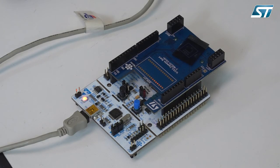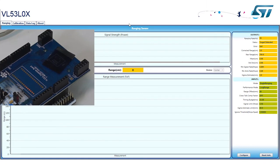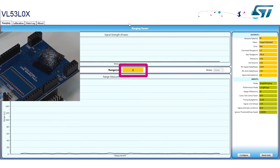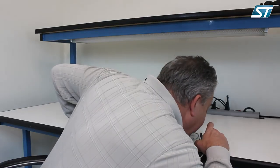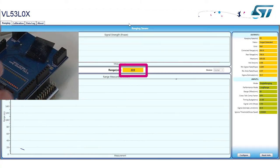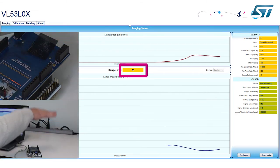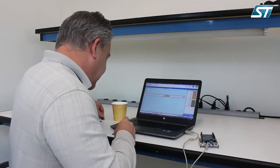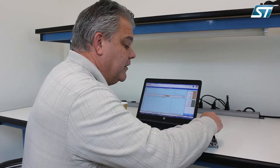This is a VL53L0X eval board, and I've used the standard piece of glass that we provide with our eval boards for cover glass testing. If we put just a little bit of debris on it, you can see that instead of seeing infinity, it's now seeing a distance of two or three centimeters — meaning just a little bit of debris makes this board not work at all. After blowing off the dirt and ranging again, it's now seeing no target, but if I put my hand it ranges just fine. So just a little bit of dirt makes this very unstable for operation in a dirty environment.